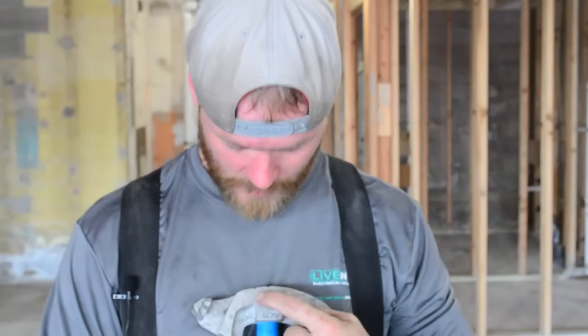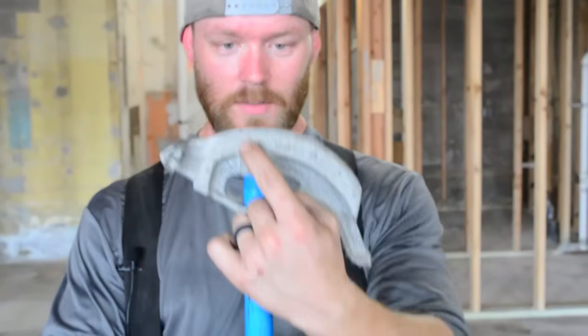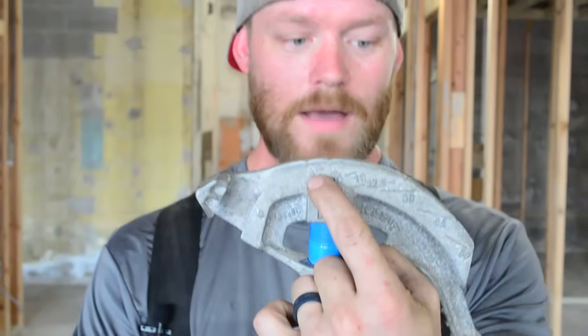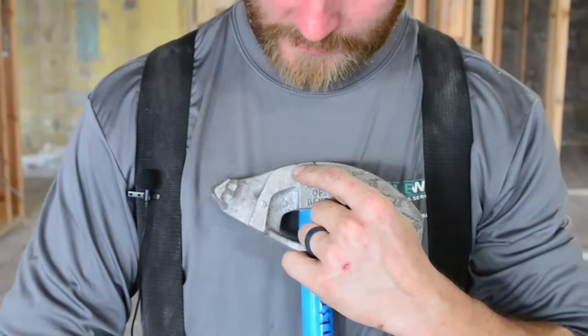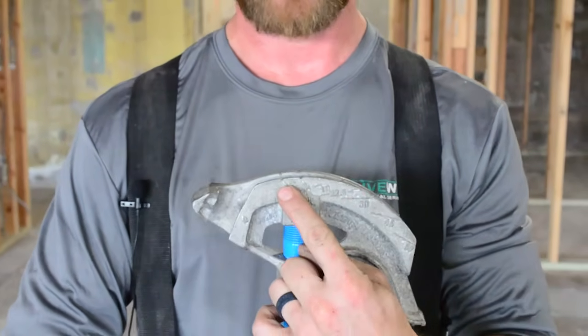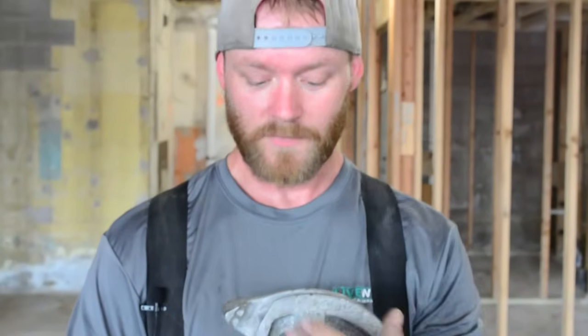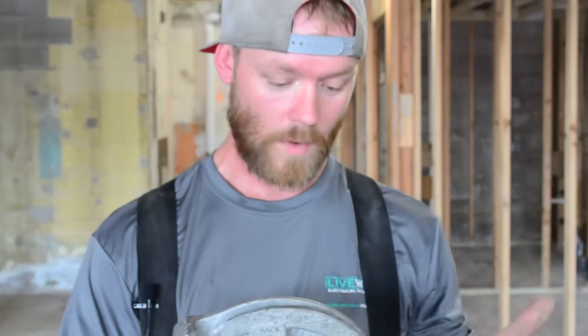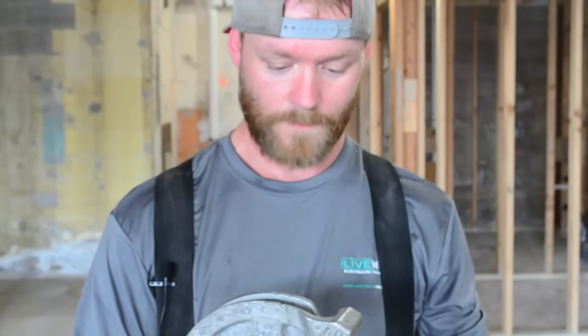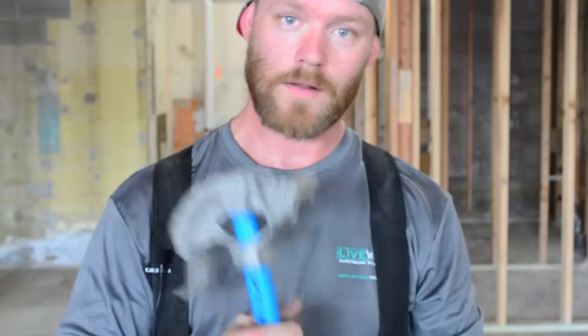The last thing, there's another tick here that you can barely see, but a lot of benders will actually have a half circle drawn where that tick is, and that tells you that's the center point of a saddle bend. Again, I'm not going to go into saddle bends, but there's a functionality for that one specific notch. That's pretty much it as far as knowing what the necessary markings are on a bender to be able to use it.